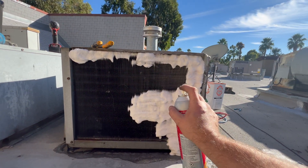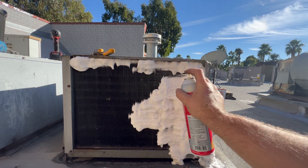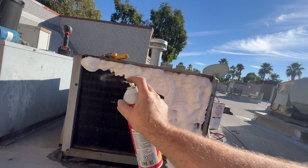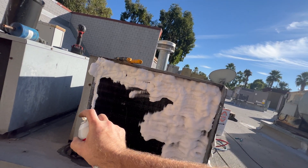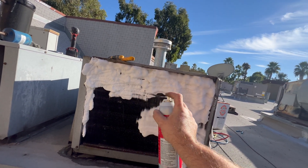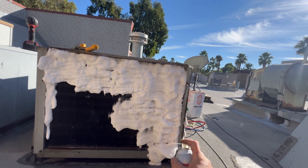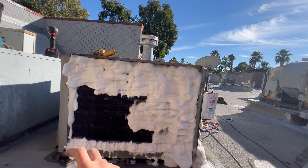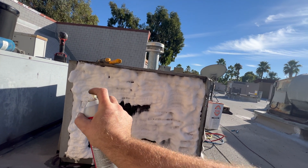I'm not sure if it had R-404A or if someone accidentally added something at some point at this restaurant. Whoever used to be here before — they didn't have a good company servicing them. I know it just by looking at the equipment and how they serviced it. So I just don't trust this equipment — the old refrigerant from here got recovered. I'm not gonna reuse it because I really don't know what was inside this unit.